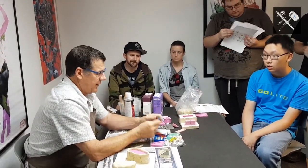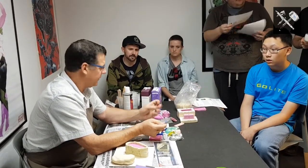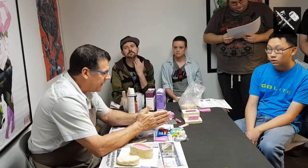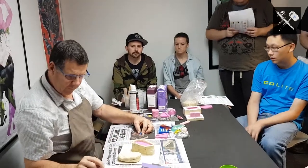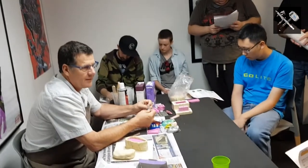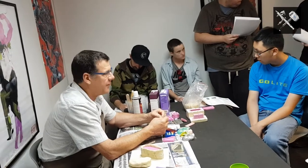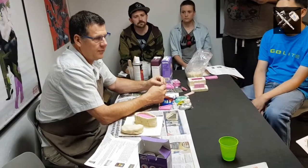Now you can take a mould straight off that. You can cut and shut it, as they call in the car model industry, where they'll get a part but they want it to look different, so they'll add to it, cut something in half, add another bit onto it, use a product called Epoxy Sculpt, which if you look right at the bottom of the first page, that's a 2-part epoxy. You need A and B together. It sticks to anything. You've got about 3 hours sculpting time, and you can sand it, file it, shape it, and turn your original into a totally different part.